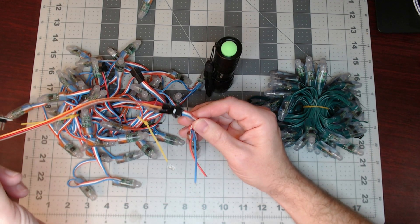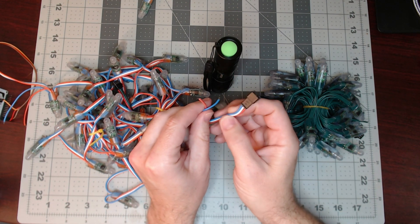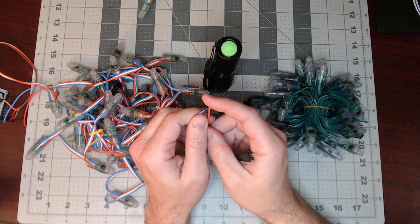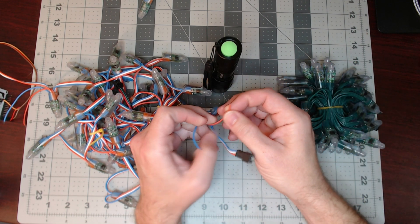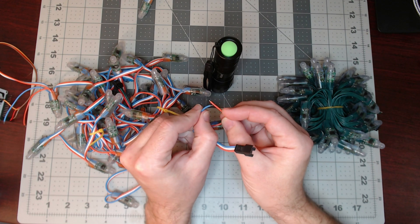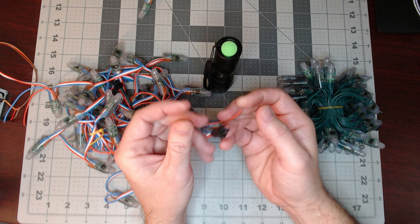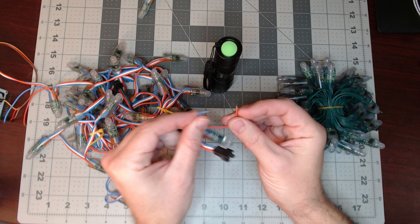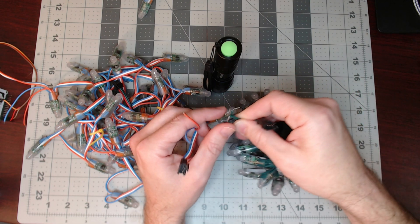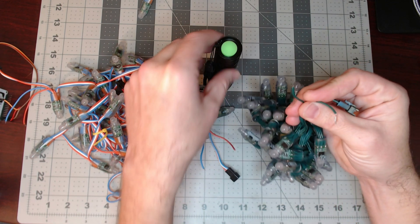Simply take your NodeMCU and put it on your first strand over to the left. This is the output of the first strand — it has the little male plug right here. These wires, if you are not going to use them between strands, you need to snip them off, maybe at different lengths so they don't touch each other, or put some liquid electrical tape or grease so they never ground out on anything. Same thing on the other side — don't just let them hang. If the wind blows and they touch each other, you'll short out your power supply and you won't know why your lights don't work.